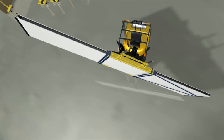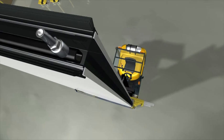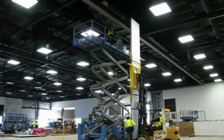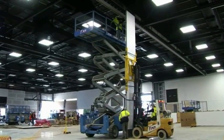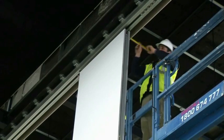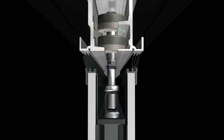As the panel is lifted, the floor team rotates it to an upright position. The forklift driver raises the panel slowly as men working aloft guide him into position under the track. The fork driver takes instruction from the men in the scissor lift. When the panel is in position under the track, the crew working aloft screws the carriers into the pintles. When the correct embedment depth is reached, lock off the nuts.